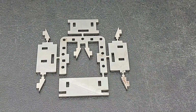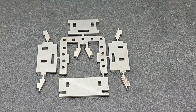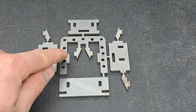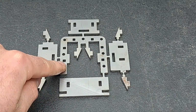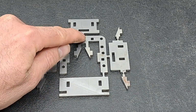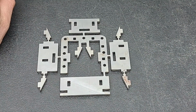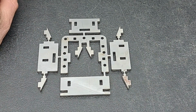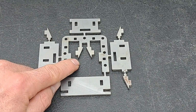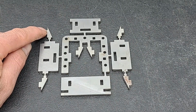This is what you get in one of the frets, and there are eight that go into making up the chassis. You've got the main U section, which is obviously the mounting flange, which goes to the frames. The round holes are the ones that I've now added to the frames, and that's where it all rivets or bolts together. The square holes are where these ribs go in when we silver solder the fabrication.